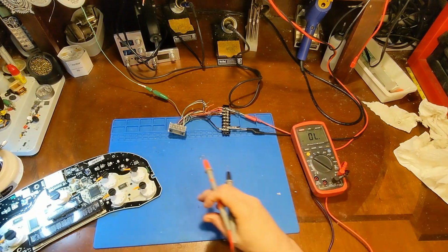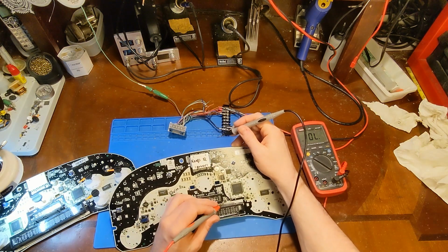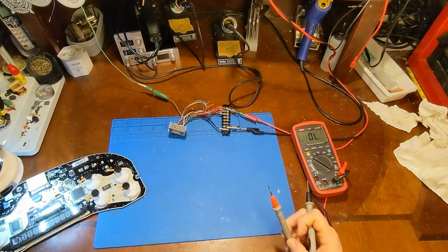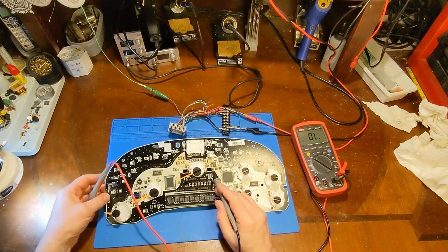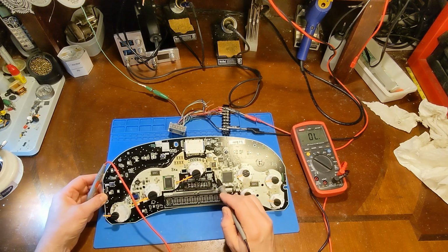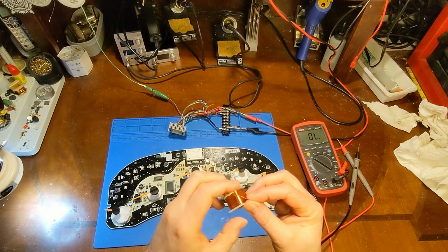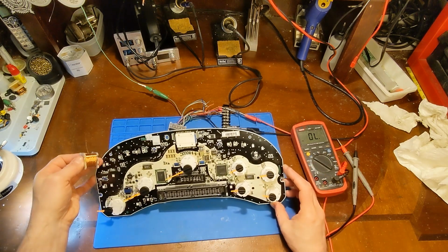So let's just pull up a known good board, and we're going to check that also. Bottom left-hand pin to the top of the voltage regulator, and we get continuity. So there we confirmed we have an open circuit. So the trace somewhere between here and here, I back traced it before, it's somewhere in this area here, there's an open, but we're just going to run a jumper in electromagnet wire. This solid strand coated wire works great for running jumpers like this. So let's take a closer look.